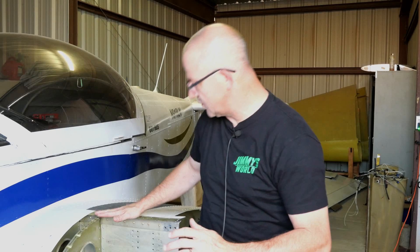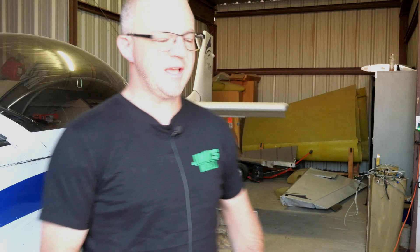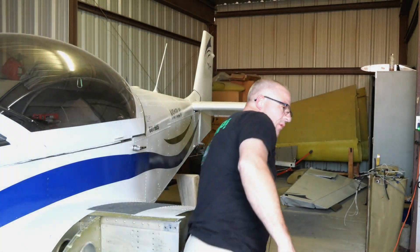Alright, so I've got that wing taken apart — this wing is done, there's nothing else I need with it. I've got the new wing coming in, and then I'm moving my other wing onto the sawhorses to assess whether we can just replace the rear spar on it. I've gotten all of the teardown complete for 8-Lima-November. I've made this cut here so that I'll be able to splice in a new skin in this position. We've got the splice plates ready to go — we got these from Zenith, this is the correct material — and we're just going to splice this into the rear section according to AC43.